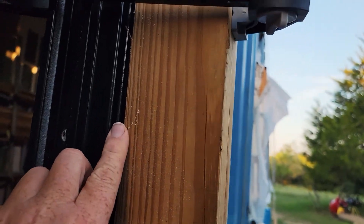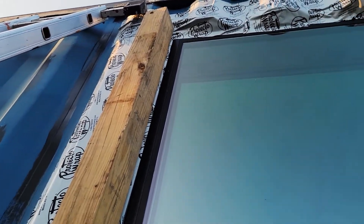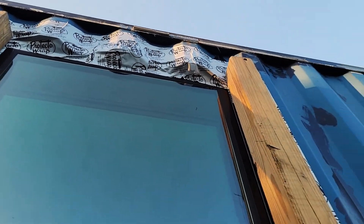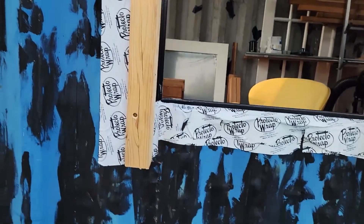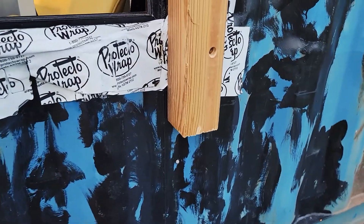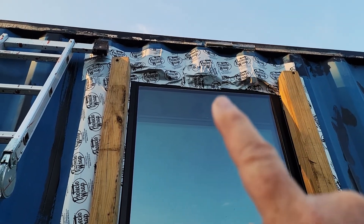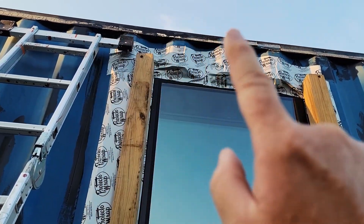I ordered brown large-gap caulk to chase the seams. Now I'm going to make the header, which will support one or two earth bags, then a concrete crown to tie all the earth bags together. I'll also pour a roof on top of the container. This evening I think I have enough time to pick out the 6x6 for the header, cut it down, put it on top of the two posts, etch where I want it to drop, and route out an inch and a half to two inches so I can put a piece underneath for a watertight seal.